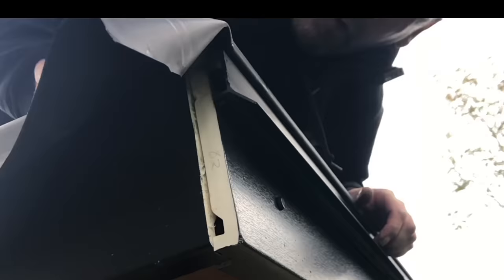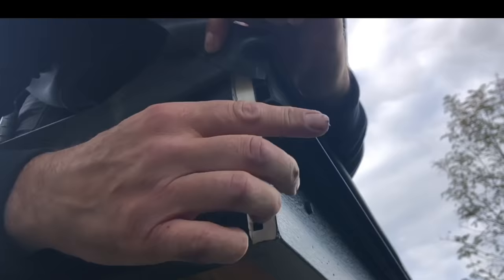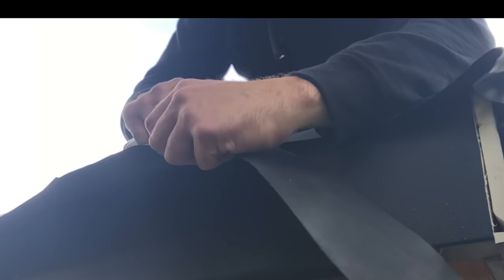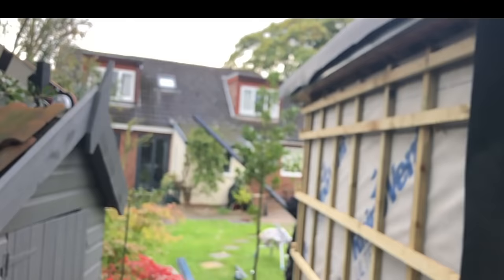I've forgotten the little polytop nails, so I'll show you those corners and trims going on tomorrow. What we're going to do now is cut this off. Manufacturers recommend a 50mm little overhang, and then the trim that Sean's cut will go on and hold all that. If you want to run around to the front, John, Sean, Adam even, I'll show that going on. You can keep filming.